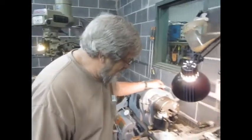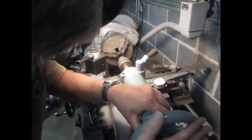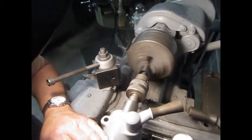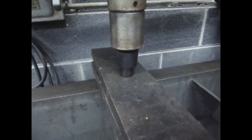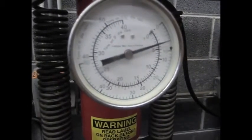Hey, I'm Lloyd, and I'm personally working on the MotorMate project myself. He's modifying some of the molded MotorMate inserts so we can test them to destruction. We're making some modifications with different designs, and we're going to try today and tomorrow to break those in our efforts to make this part unbreakable, or as close to it as humanly possible. So we're doing a pressure test on a MotorMate end cap. As we're squeezing down, this gauge is going to start rising. This end cap will take up to four tons of compression before collapsing.